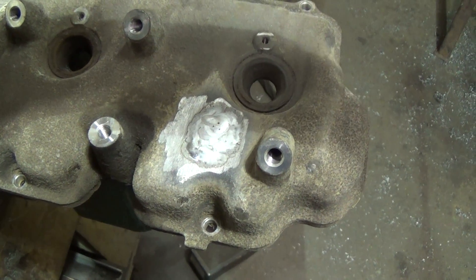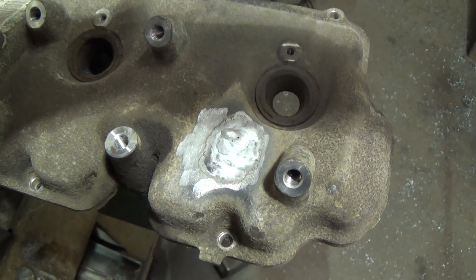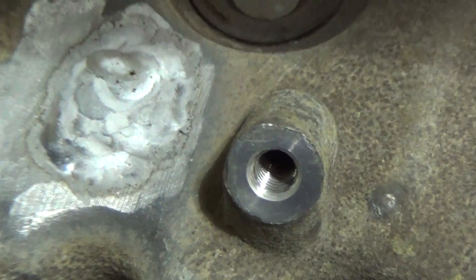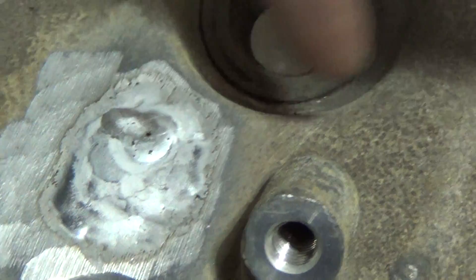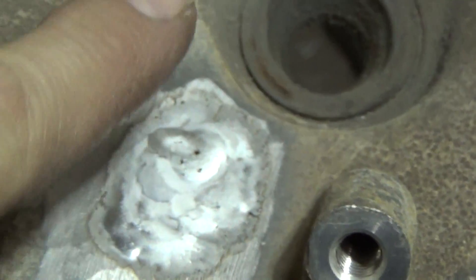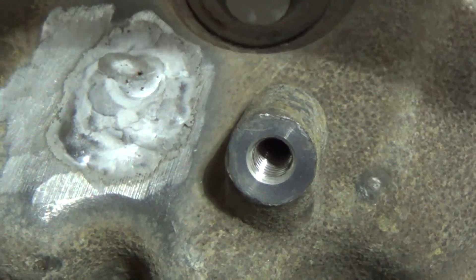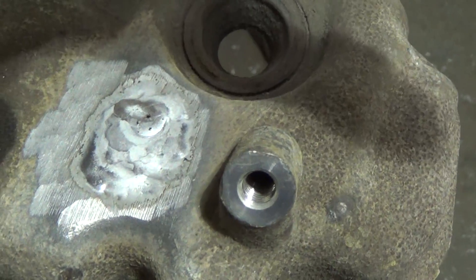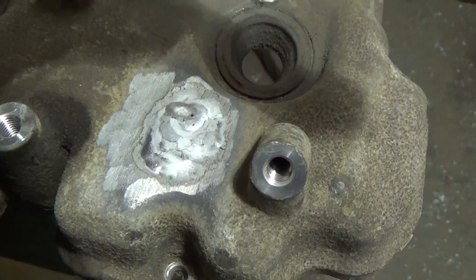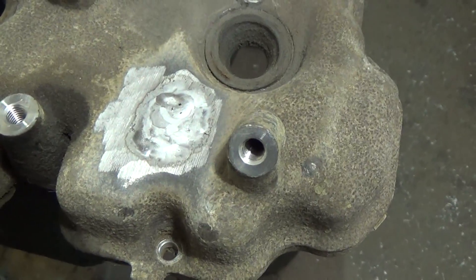Okay, so I think we got it. Didn't go too bad. It's a little dirty in there — you can see some of the sootiness that floated up to the top. I did have to chase it a little bit in that direction because naturally it tended to get thin. You saw me bevel it with the die grinder, but not bad — not bad at all. I think we got a pretty good repair here and they're going to be pretty happy.